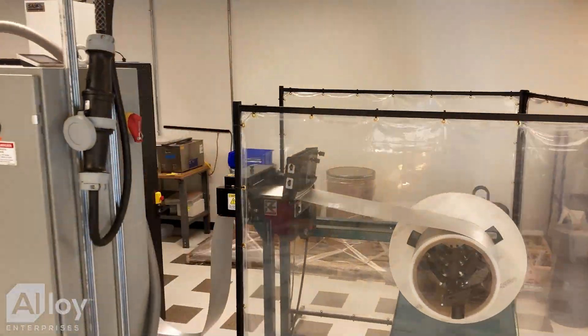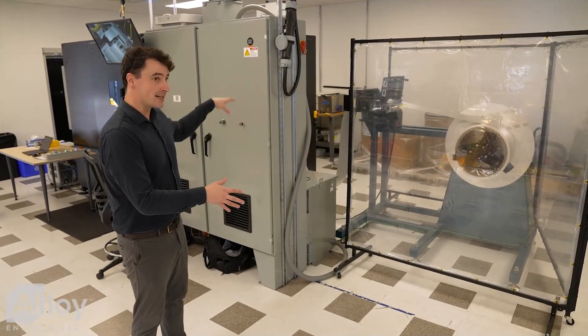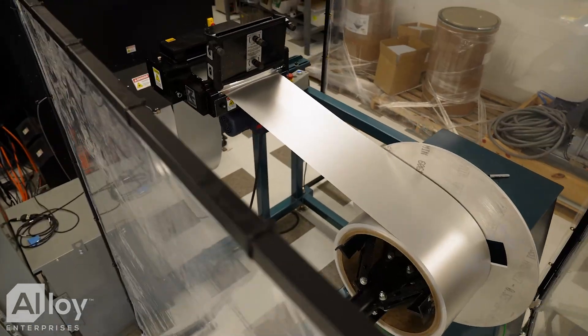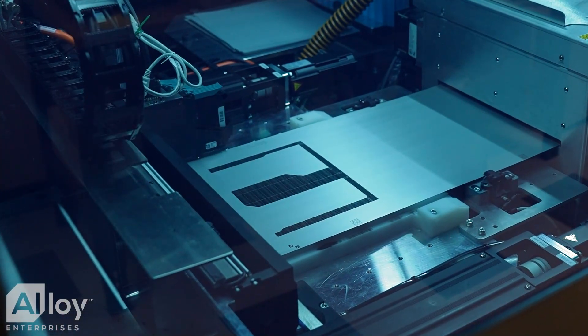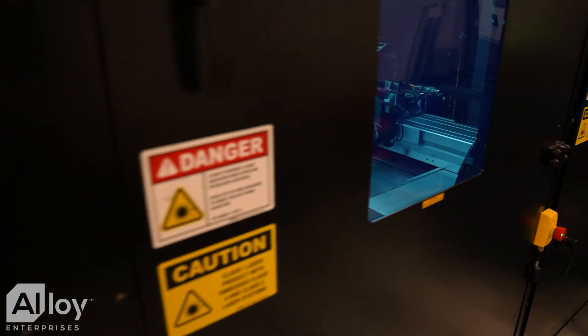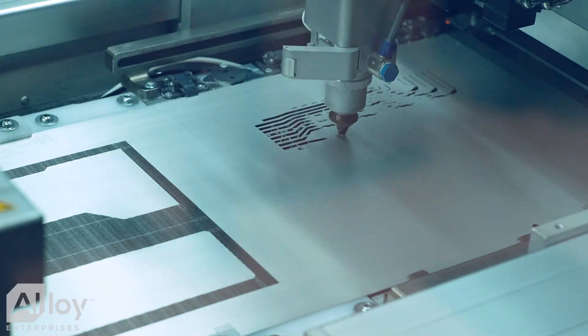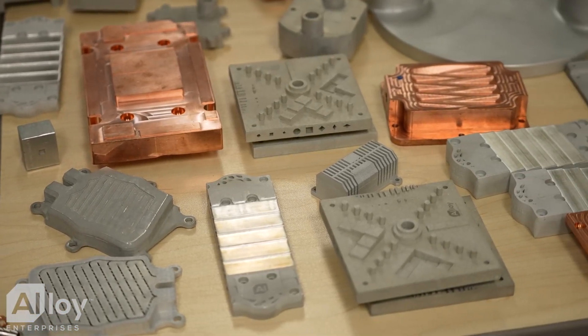This is our construct machine. This is the part of our process that takes the prepared coils of our feedstock, feeds it into the machine, where it's then cut into individual and discrete layers. First, we apply an inhibition agent to act as a mold release on specific regions of the layer. Then laser cutting begins. We're able to define features down to the width of the laser cutter, meaning we can create some of the smallest features that can be manufactured in a scalable way for components like this.